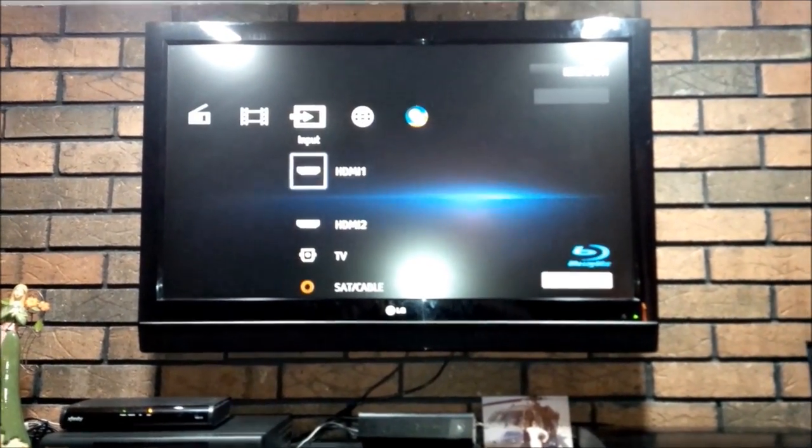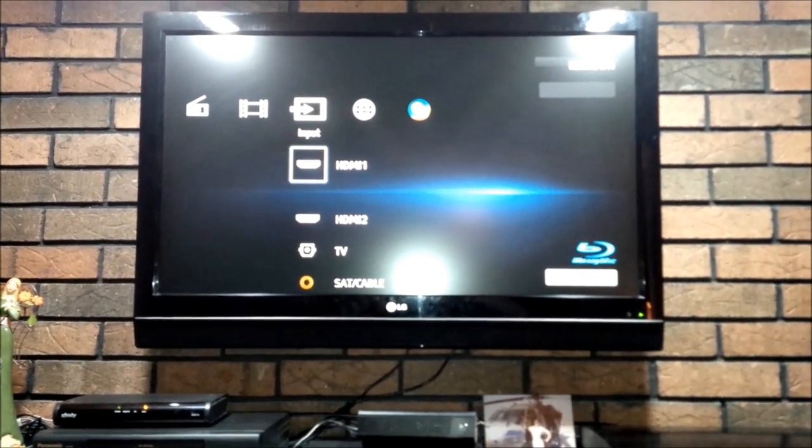Alright, so it's plugged in, red light's on, gonna turn it on. Blinks. Let's see if it lights up. It's lighting up. Wow, okay, so it works. So, basically I had to replace all those capacitors, and that took care of it.